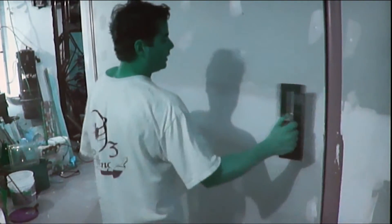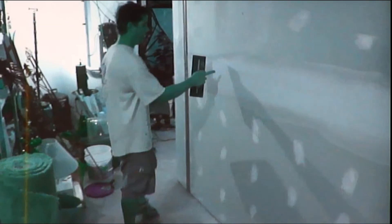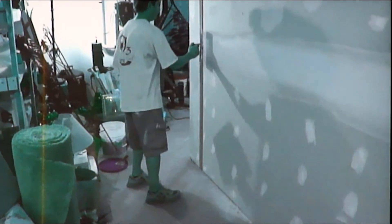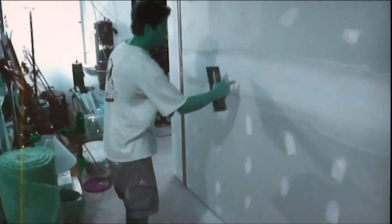Okay, and now I'm going to take this wipe, and now I'm going to put the trowel on it and do the final skim. I'm going to skim hard on this, so I'm going to angle it back to take away mud. That's what comes off there, and now I'm going to come down here, and that's what comes off there. There is a line here that I'm not happy with, so with my clean trowel, I'm going to come up to the top and go into it like that. There's a bunch of stuff here, so I'm going to come in from the bottom and do it like that, and that's what comes off there.